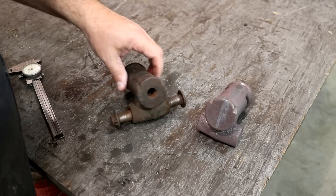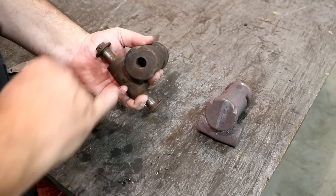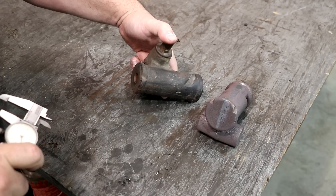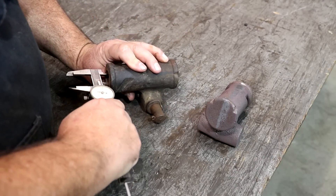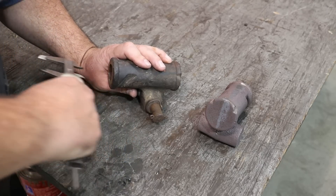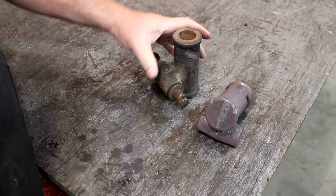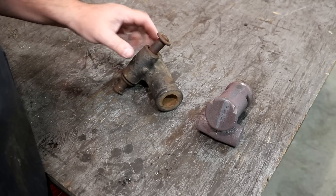So just a closer look at the casting here, the original - you can see we've got a large hole and a small hole. The small hole is 0.625, so that's 5/8 of an inch. The large hole looks like 1 inch 0.157. So it's roughly 1 and 5/32nds on that one. That's an odd size hole. I might have a drill bit that size, hopefully, and then we'll figure out this cross hole.